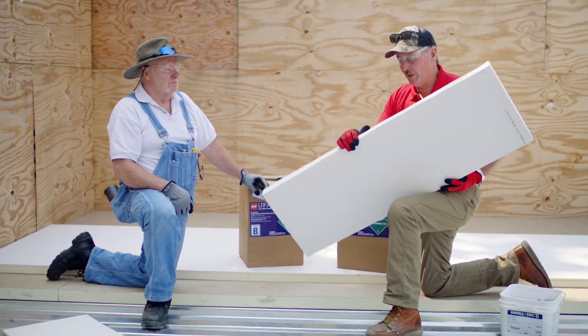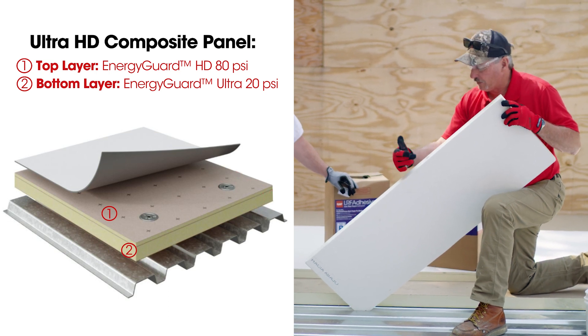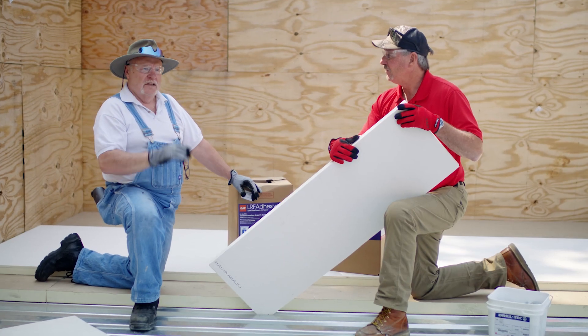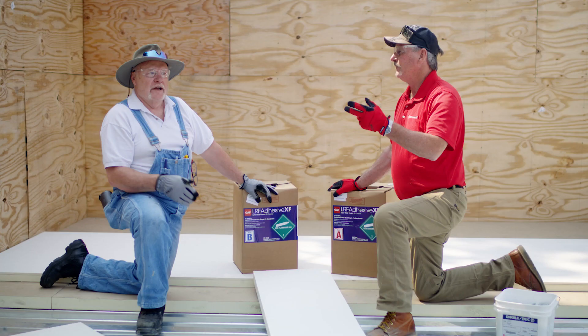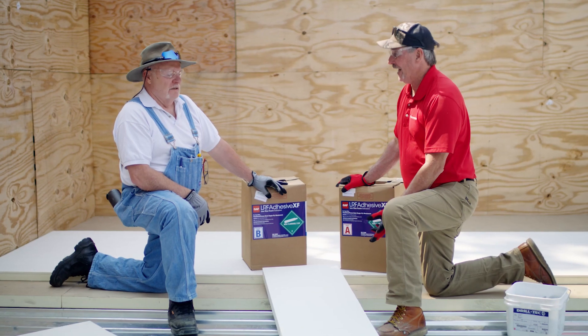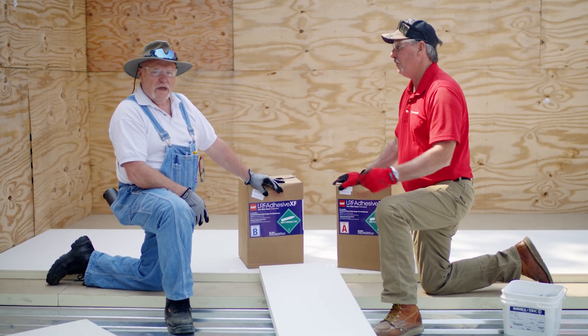So we have a piece of half-inch laminated to what's probably two inch. We can get different sizes in thickness and in boards — four by four or four by eight. A lot of contractors are using a gypsum type material cover board. But the PSI on gypsum is 900 pounds compressive strength, while this is 80. A lot of jobs are getting over-engineered by using that board, because you really don't need 900 PSI.